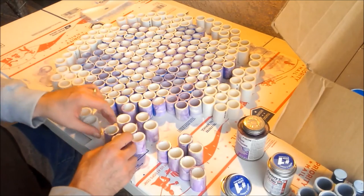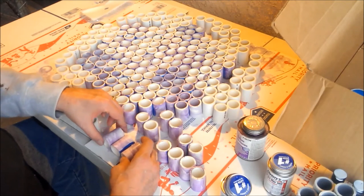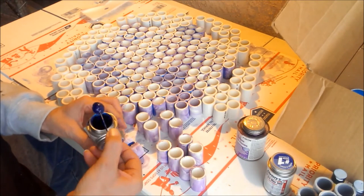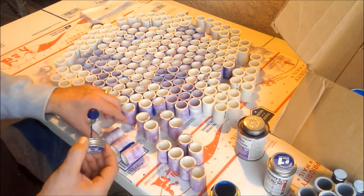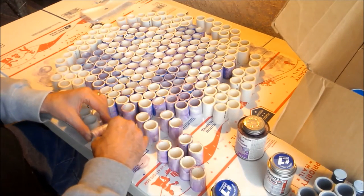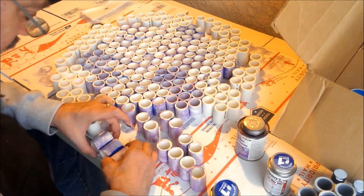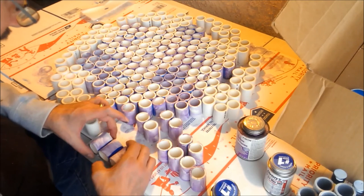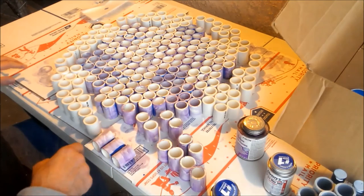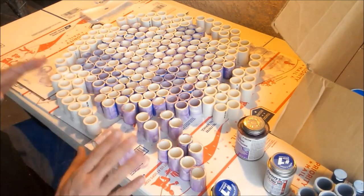Good. Okay, now, first thing we're going to do is take this center piece, and we're going to add one to it. Same way as you did the other two. That lid we glue, line it up. Boom. Again, a little squeegee action there. And lay down the board. Now, since these are going to go on the sander, I'm not worried about that. I'm lining up the center of it, trying to get everything so if I sand off a quarter inch or an eighth of an inch, it'll all be flush. That's what I'm looking for. So it'll end up sanding flat.